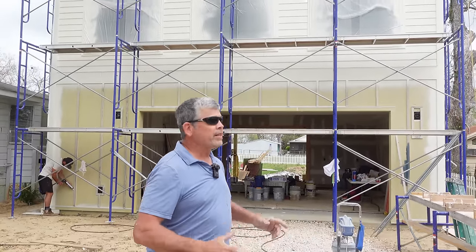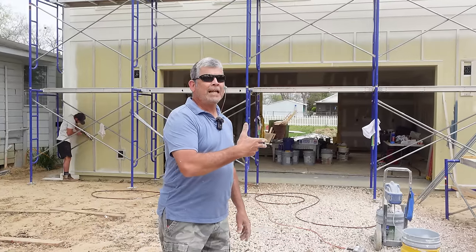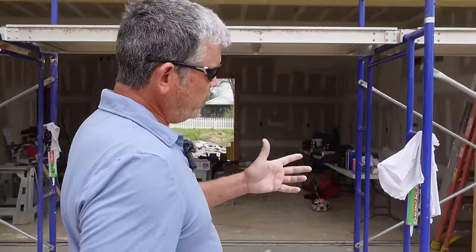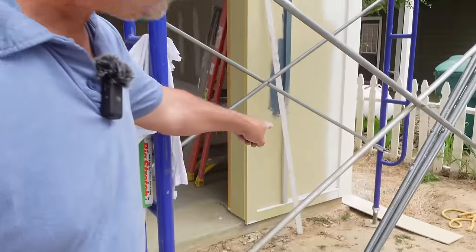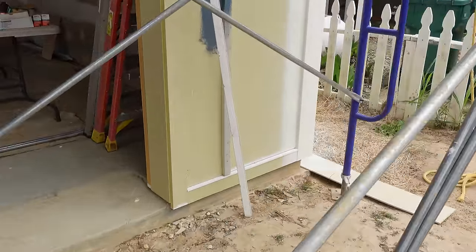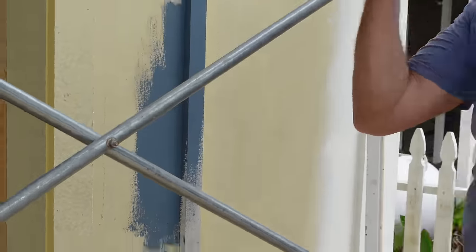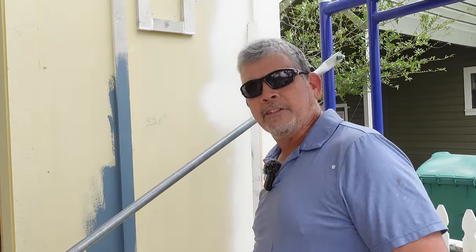It won't take long, but in the meantime, we gotta hit those battens a little bit. We had a couple crack. Remember in our batten video, we showed you that they cracked? We're gonna actually replace this one, and then I'm gonna hop in here, Jordan, and then we're gonna get our Big Stretch, and we're gonna caulk here and here all the way around the building. So while that's drying, we're gonna grab our tools, get this done, let's hop to it.